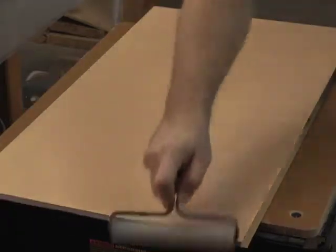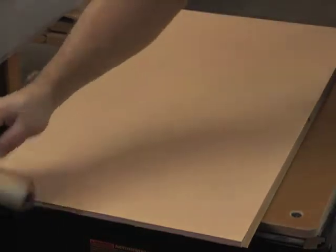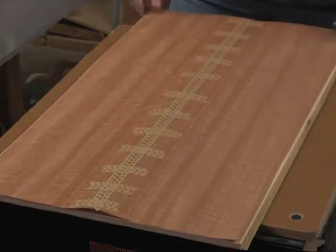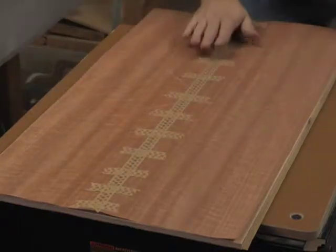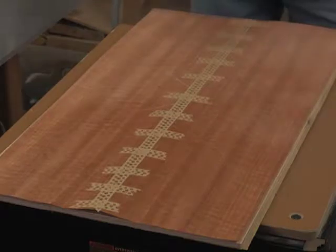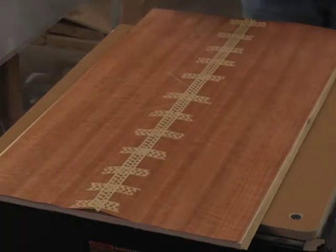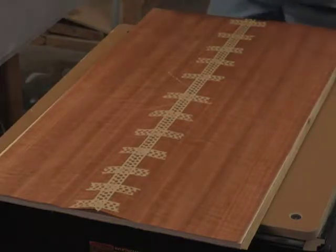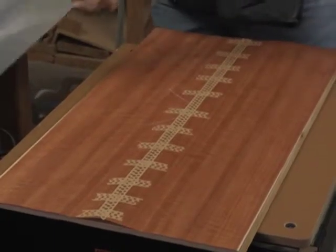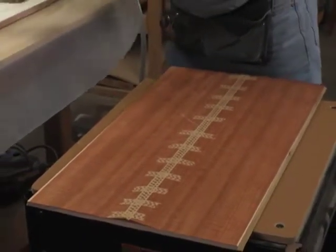Because you don't have full control over how veneers could slip in the bag, that's why it's so important that both the substrate and the veneers are oversized — very, very important. Sometimes I have to veneer things that are already final size, but I dread it every time. The veneer has to be preferably not hanging over the edges, since it will go on the top side in the veneer bag. Because there's so much moisture in here, it will never fully dry in the veneer bag — you have to pull it out and let it finish drying.